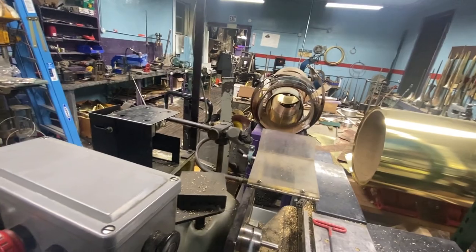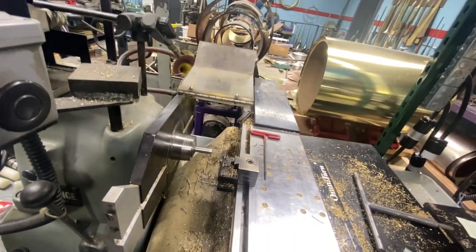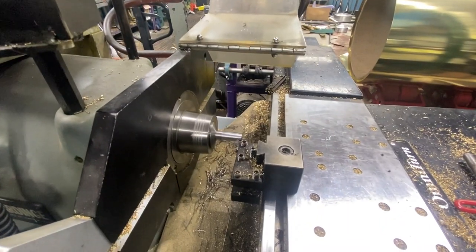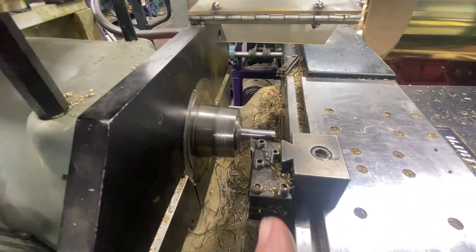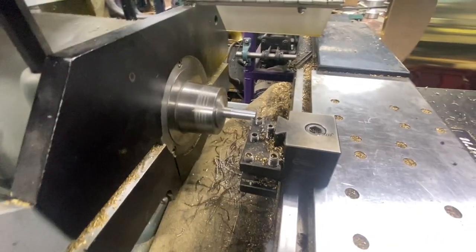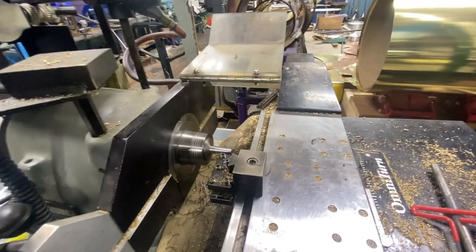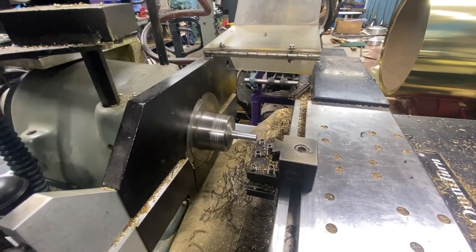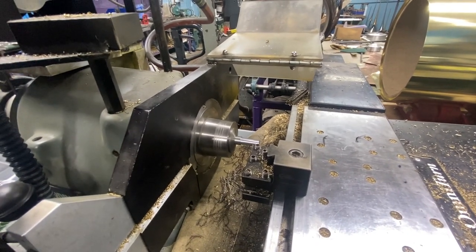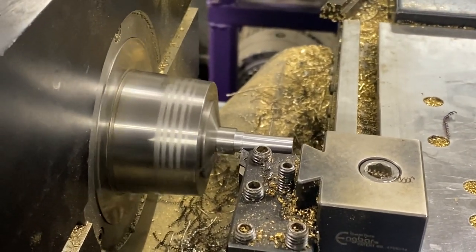Auto magic mode - and yes, I wear safety glasses. Take your turn off the spindle - M05. And this is my budget Swiss lathe. It's pretty freaking impressive. I guessed at all the depth of cuts; I haven't done too much steel on here so I didn't know for sure, but it seems to be working out. Every time it reaches that corner, it's jumping out in both X and Z so it doesn't drag on either the shoulder or the face of the material. That's going to help our tool life, which is really important here if the tool wears, especially because I don't know what this insert is - it's a questionable insert. That's going to mess up our stop length, especially if it chips and we have to change an insert. We're just going to take it nice and easy. This is the last pass - the next one's going to be the taper. You can actually see both X and Z moving there - that's cutting the taper.